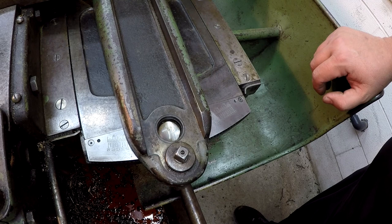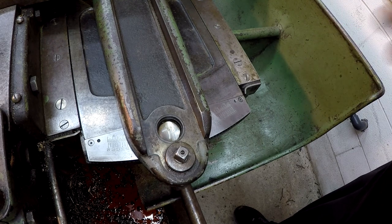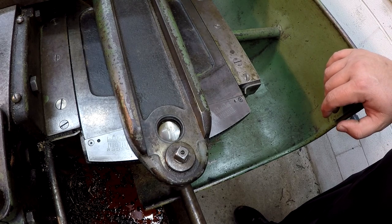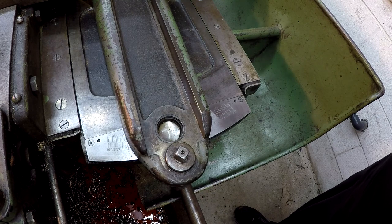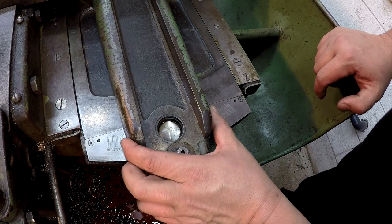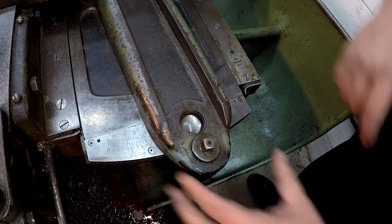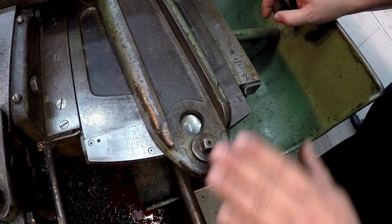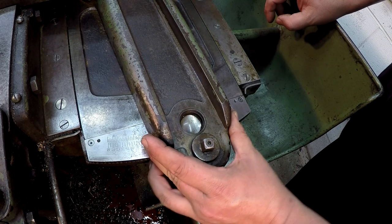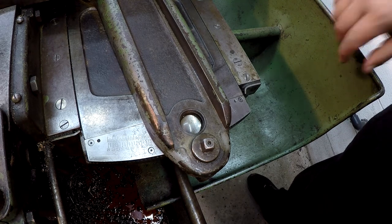Usually whenever we used to do a prop shaft, I had a good factory end that had a good taper, and I would use that as a sample to set up and indicate 0-0 in the chuck and get your taper attachment set. What you do is you crank it down and run the indicator along the part, and then whatever difference you had, you come over here and slightly adjust this until it's nice and straight and parallel with your taper.